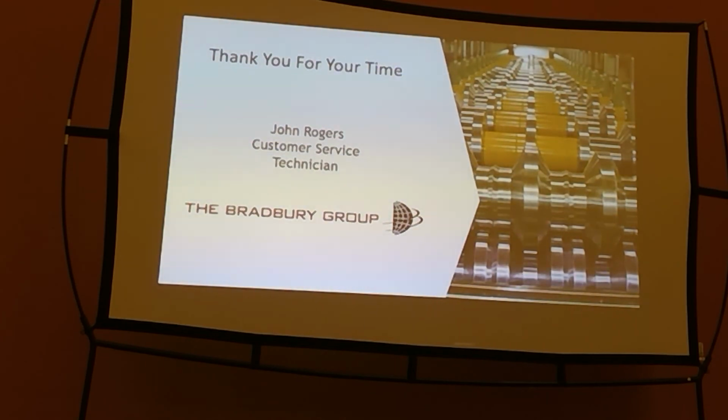One of the things that we do is, you talked about tolerance getting out of place over time. We take a template panel, whether it be a profile or a trim piece, and we get the machine back to tolerance. We write template panel on there, put it on the wall, and at the start of each day, we're putting that panel on top, or aligning it with the first piece that comes out, to make sure we're not slowly losing that. We're able to catch things before it gets too far out of whack.